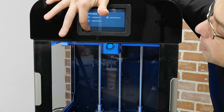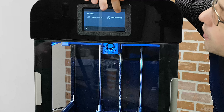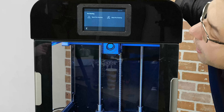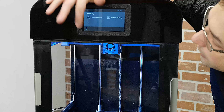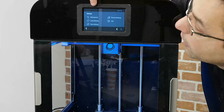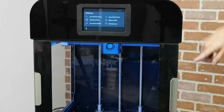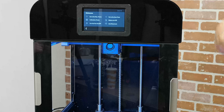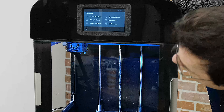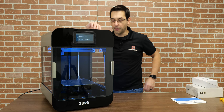Go to the Zero Point — that's going to home all axes. I'm comfortable doing that now because we've moved each axis independently. Interesting — so home is actually at the bottom. There is a limit switch at the bottom; that might be a kill switch in case it's gone too far down. It used the inductive sensor to sense the bed, and that worked as expected. It's a cool fail-safe — in case Z increases to its maximum, it won't go any further and start banging into the bottom.